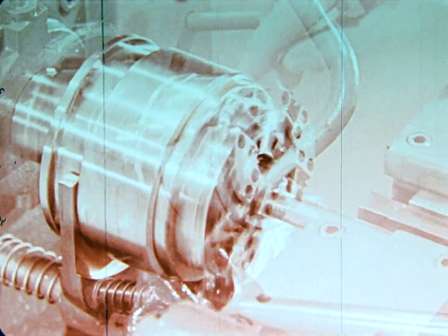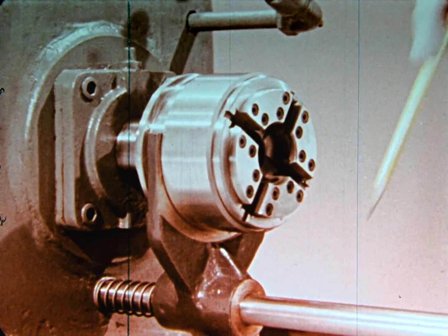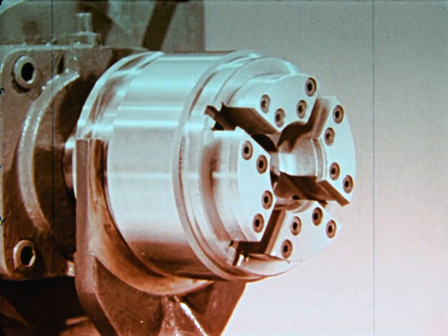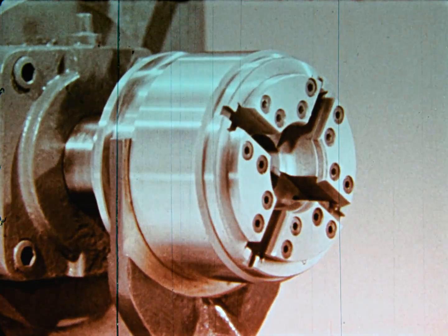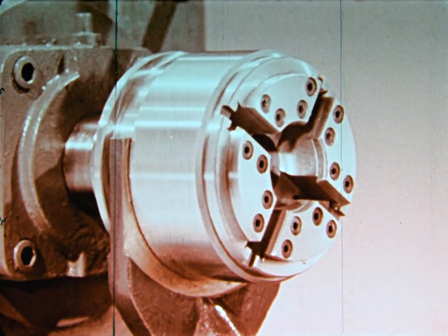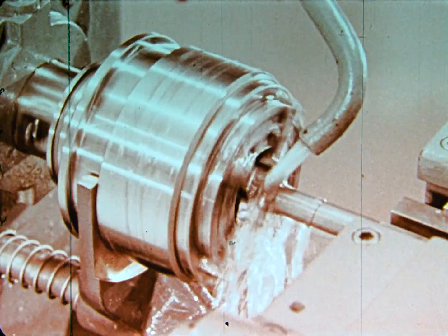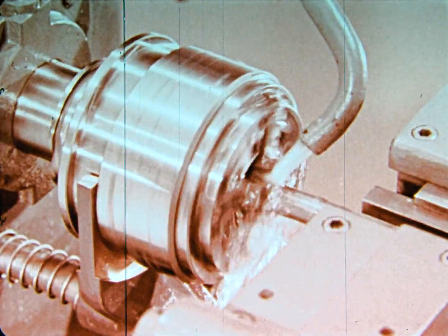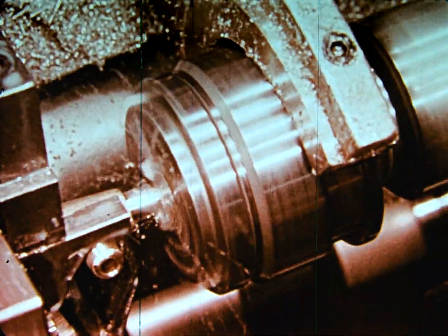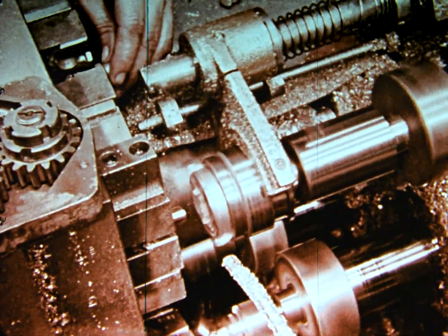This head is opened and closed by a yoke and trip rod mechanism, which provides both positive opening and positive closing, and can be installed on almost any live spindle machine. Compact design and yoke tripping make this type head ideally suited to jobs where there is little machine clearance. Here's another high production setup that demands the most reliable threading tools available using a rotary head.